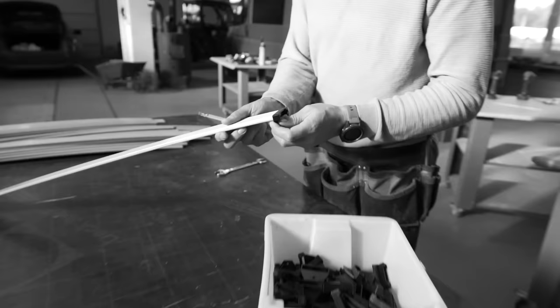It works really simple, this is the only device. It's 12 volts. It just goes through the fuse box. So one actuator needs positive and negative wires, 12 volt. And what this device does, it switches the polarity. So minus is plus, plus is minus. So that's for going up or going down. There is no synchronization, none of that. They're all on the same branch of wires coming to this. And they're not perfectly synchronized, but if it's like a 1 second off, nobody cares.